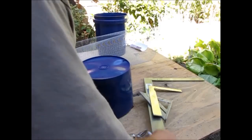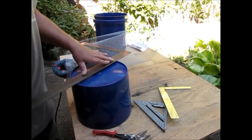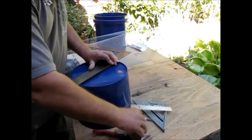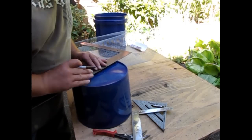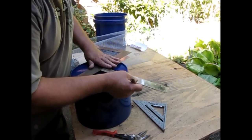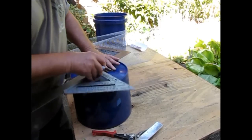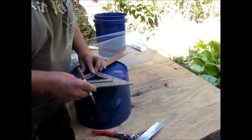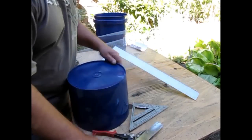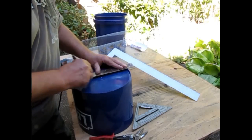On the bottom of this bucket they actually gave me two center marks. If you run a framing square across it you can see where that goes, and they also give you a center point location. Using two squares lined up I'll be able to mark a sweet 90 degree corner right where that belongs. My speed square works a little better for that — line this up, boom. Now with that mark I can just straight edge across from that mark through my center and mark the other side.